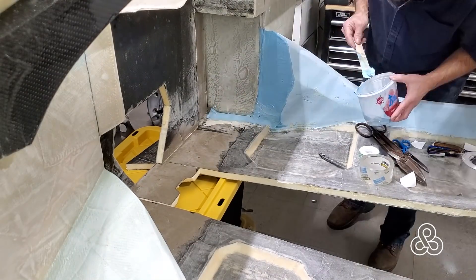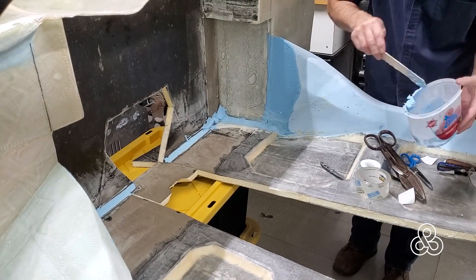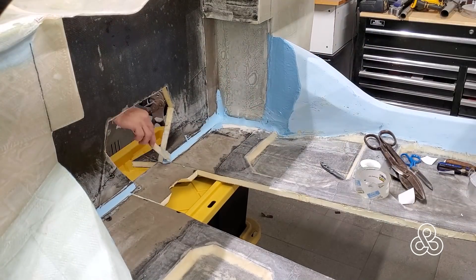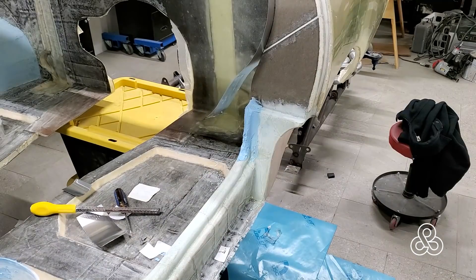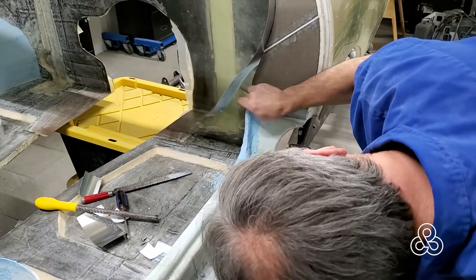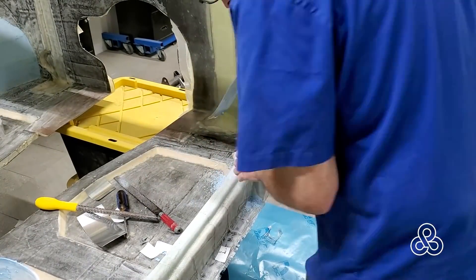I've got extra slurry mixed up so I figured I might as well put it somewhere useful — I've got these little joints in the footwell and I'm going to put a little radius into the corners, a good place to use up that extra slurry. Nice clean round radius that will make it easy when I do the fiberglass work up there to get around those bends. Come back the next day when it's set up, take a couple of screws out so the flashing swings away, get the rasp out and start shaping — just rasp and a little sandpaper until I get exactly the shape I want.